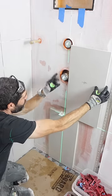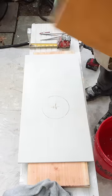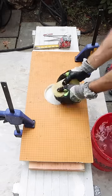On the shower wall, I had to cut a large hole in my tile, so I used a huge diamond hole saw, created a template in KERDI board, placed the template over the tile, and squeezed some water in it.